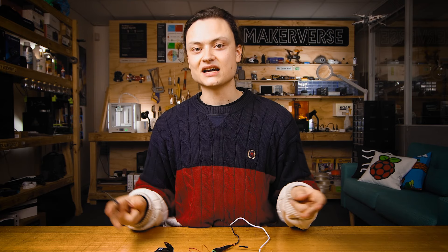If you wanted to use only one power plug for this setup, you can always incorporate a two-way 2.1-millimeter DC barrel jack splitter and a DC to USB Type-C adapter. You would attach that barrel jack splitter to the DC power supply, then have one end power the Raspberry Pi through the USB-C and have the other side power the servo.